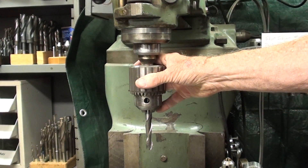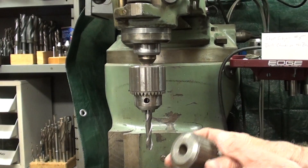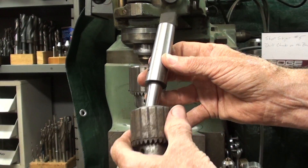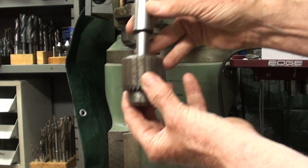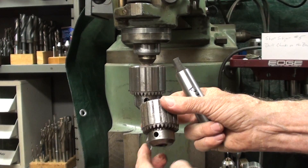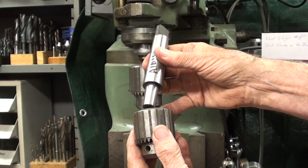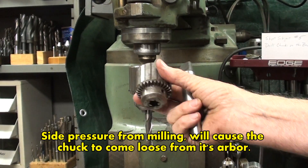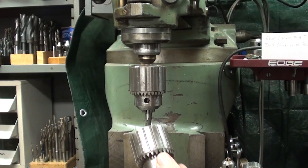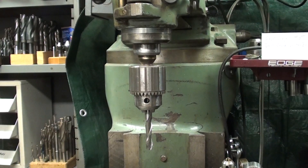Number three is probably the most important reason not to use a drill chuck. Remember that most drill chucks are mounted onto their arbors with a Jacobs taper. Now that's fine for drilling straight up and down — works great, they never come loose. But when you start to mill with a cutter to the side, they are very likely to come loose from this taper. When I was teaching, I can still visualize how many of these were rolling around on the floor. Finally I had to hide the chucks and tell the kids you are using collets or tool holders only.